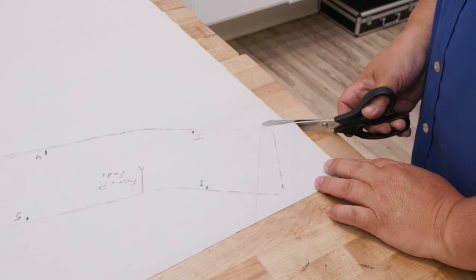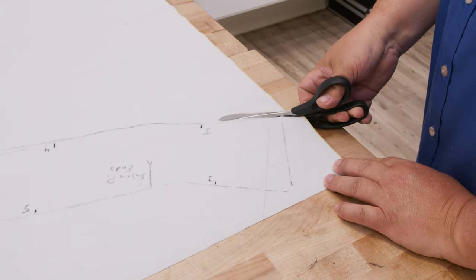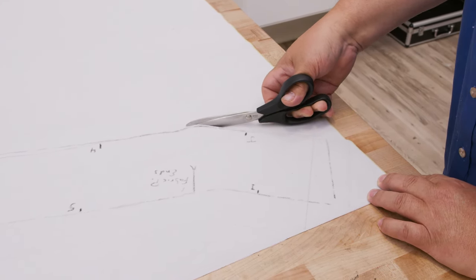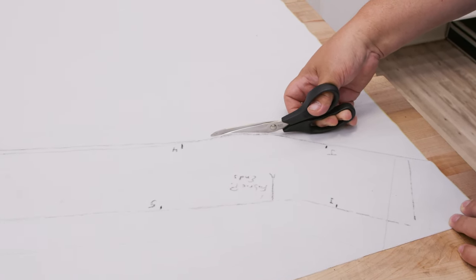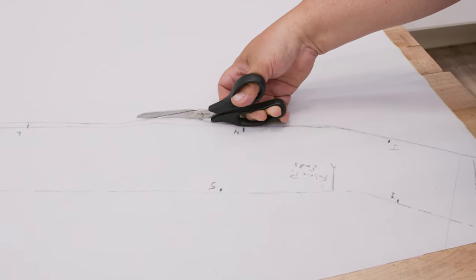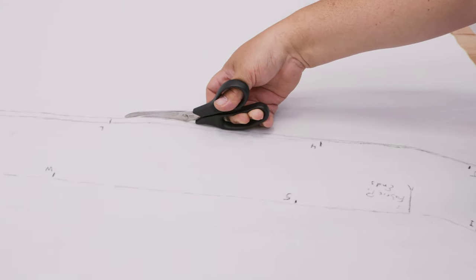Okay, now we cut this exactly to the right size, and usually when I'm doing channeling or making my own channeling, I cut it oversize. But the reason I'm not doing it here is this channeling has a lot of shape to it. Most channeling has no shape to it. So I am cutting it almost verbatim to the size that it originally was so that I can make sure that my channels are perpendicular to the edge.